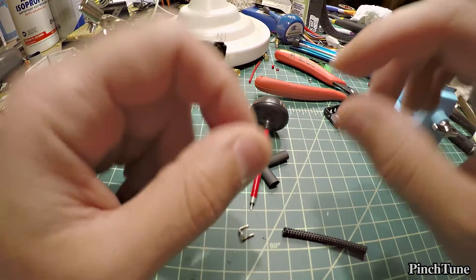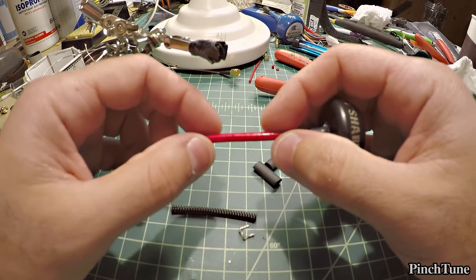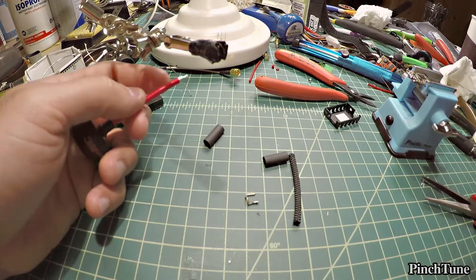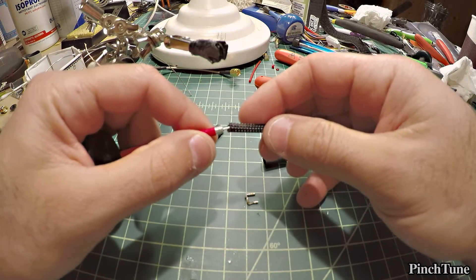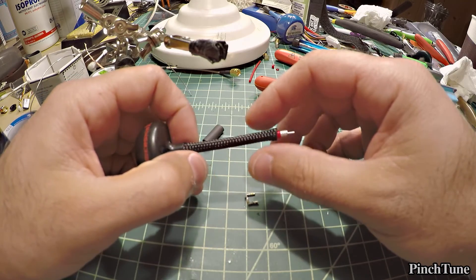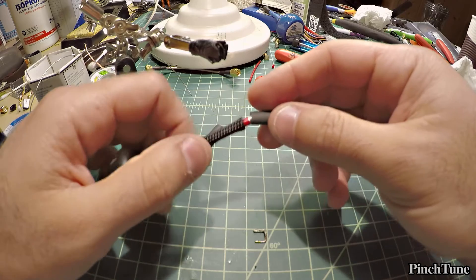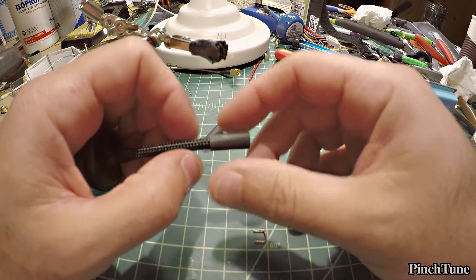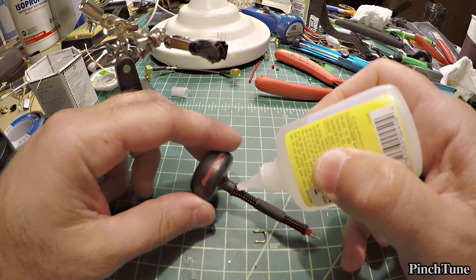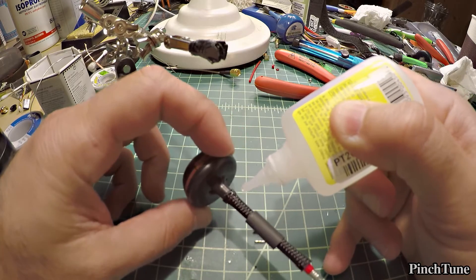One thing I like to do with all the antennas is add this mesh stuff, simply because the insulation tends to get pretty messed up and starts looking ugly. So I like to protect it first. I use 3-2-1 shrink tubing — let's put that in there first. The reason I use 3-2-1 is I need it to be tight but also need to be able to stick it in there. I like to use a little bit of CA to hold it in place — just a bit is enough.